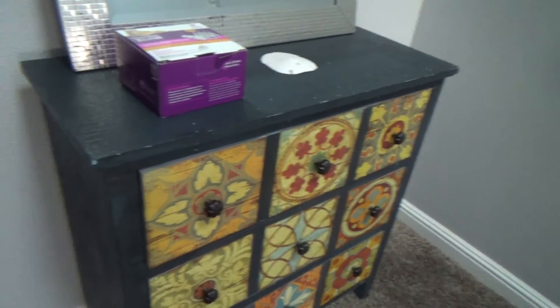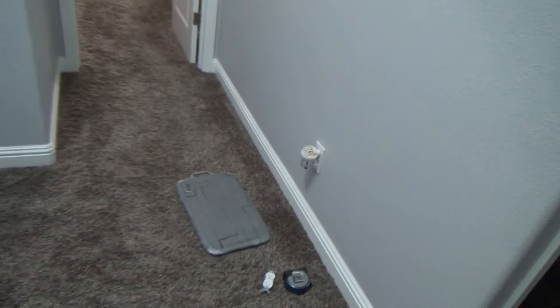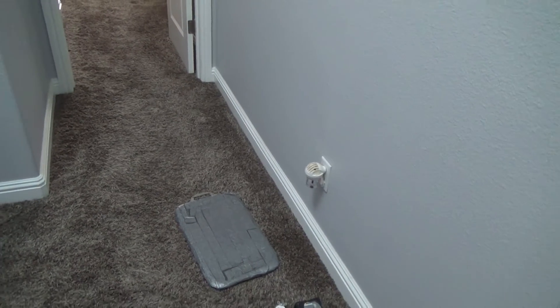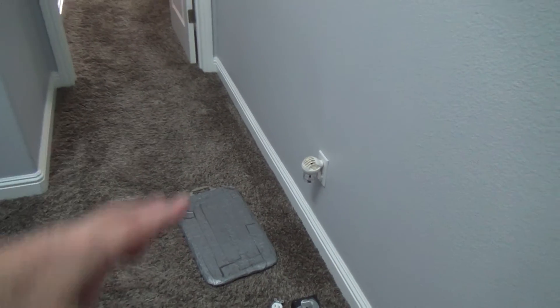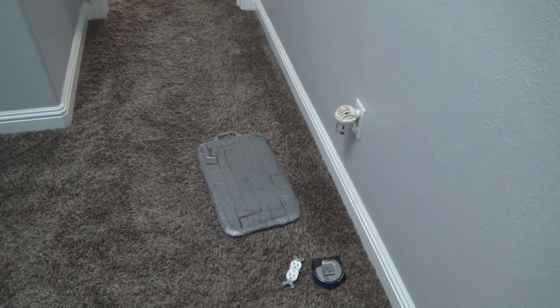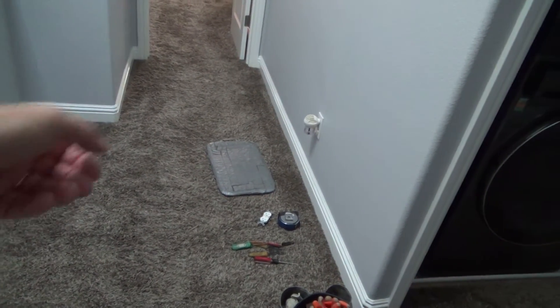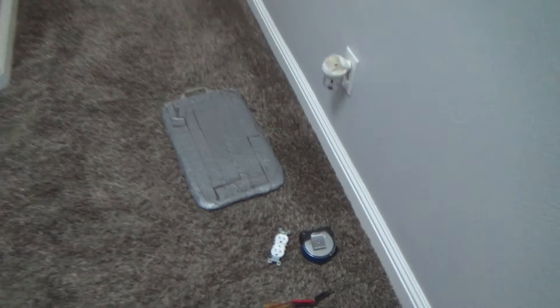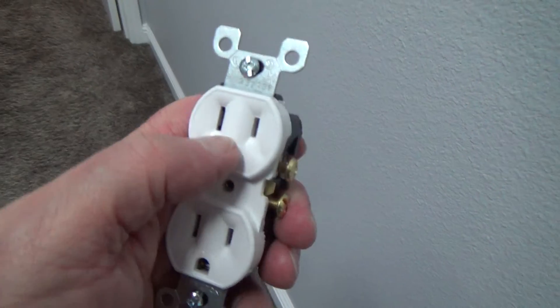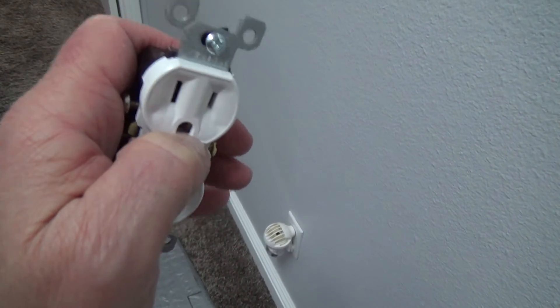There's no plugs down low anywhere in this hallway, so when you run a vacuum up here this is the easy one to plug into — everybody plugs in here, that's why those prongs are really super loose. So even if you have an electrical outlet that's still working but the prongs are loose, go ahead and replace it. Maybe you only have two or three in your house where every time you plug in the vacuum it always wants to come out. Go ahead and replace your electrical outlet. But if you have a broken electrical outlet where the ground prong slot breaks — did you know that's a defective outlet?